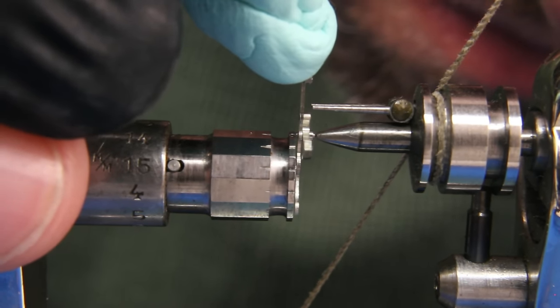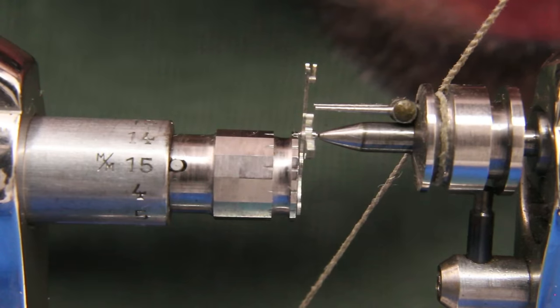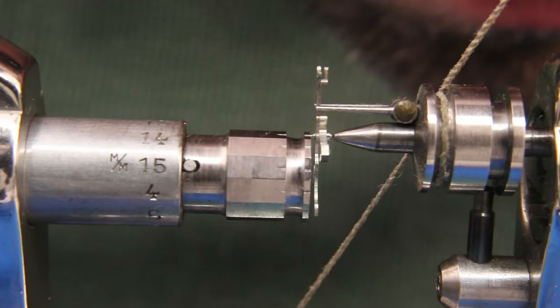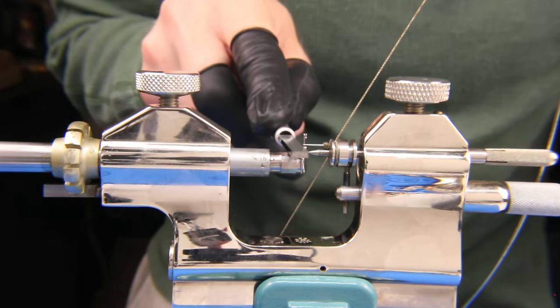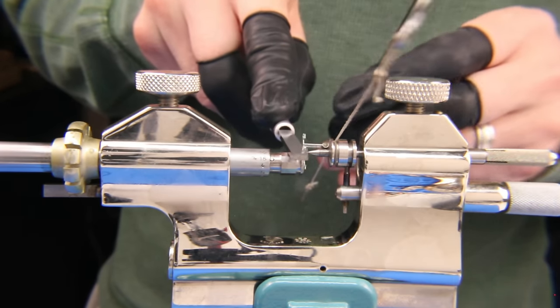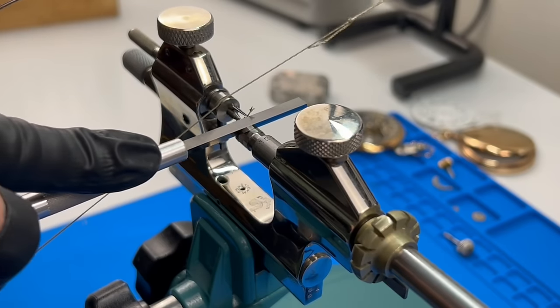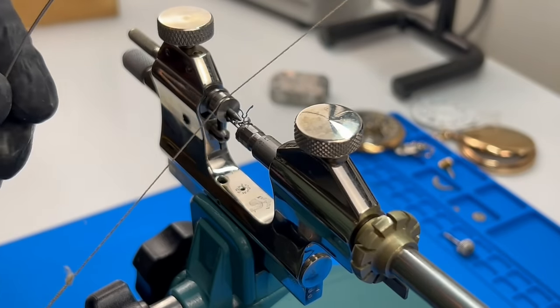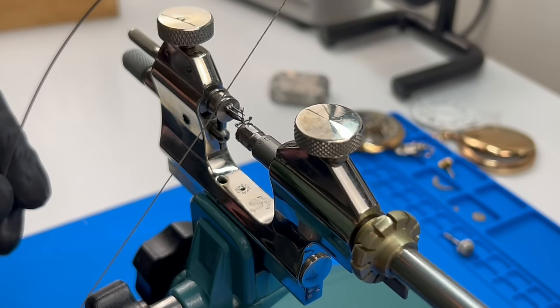The burnishing process work hardens the pivot by pushing material over it longitudinally along the uneven surface until it's smooth. When the burnisher bottoms out on the drum, the pivot has then reached the size indicated by the marking. When burnishing a damaged pivot, it's always important to consider the trade-off between size and smoothness. The overall diameter of the pivot was reduced to 0.127mm, not too small to introduce any meaningful side shake, but its smooth and flat surface is restored.